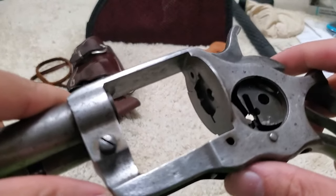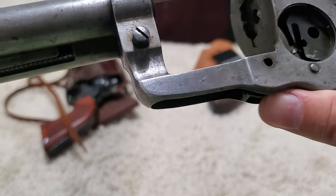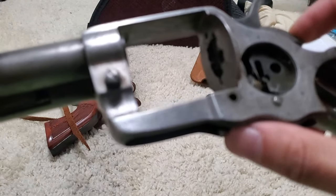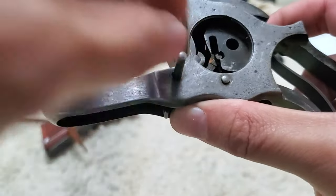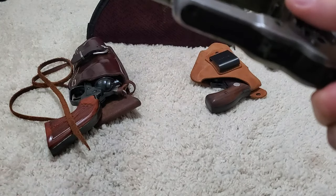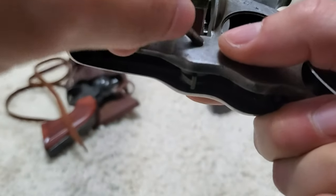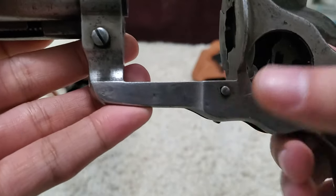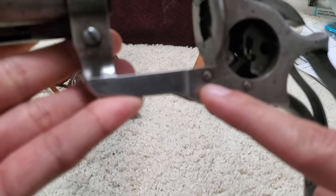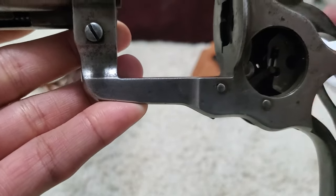Next I think we should put in the trigger roll pin. We haven't put in the trigger or the trigger return spring yet, but I'm placing it now because if it's not in the right position, it's hard to catch the hammer for the hammer screw. The trigger roll pin hole is super loose — it's very easy to just fall right through. I think the trigger hole is oversized on purpose, and once you push the trigger guard in when it's set correctly, it puts pressure. This pin was not easy to move like that when I got the gun.